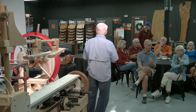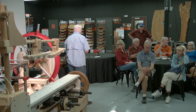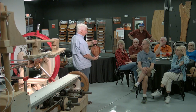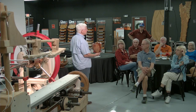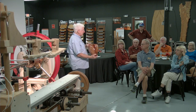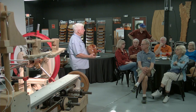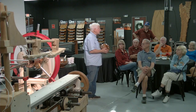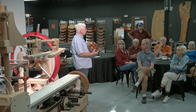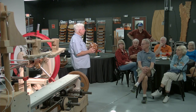For example, that hollow form — when you're putting epoxy on the inside, how do you make sure you get a good coat on the bottom? Well, what I'll start doing is actually pour it in, then swish it around some, put it on there, and then start with the brush. That's easy — it's trying to make sure you get it up here on the shoulders that's the fun part. As it's turning it's flattening out. If you feel inside here, you can see how it's flattened out. It's covered everywhere.